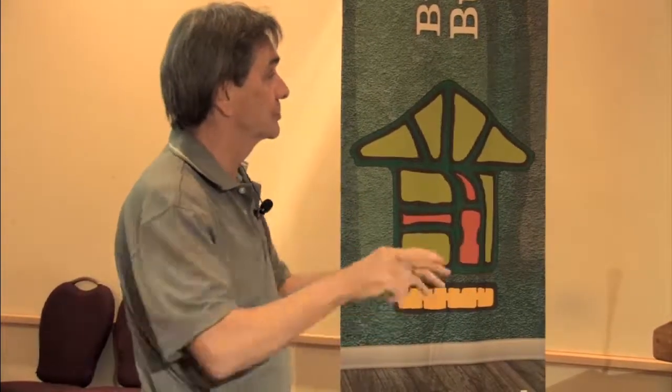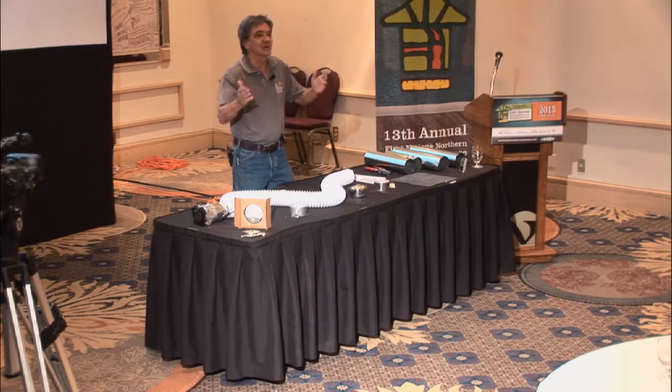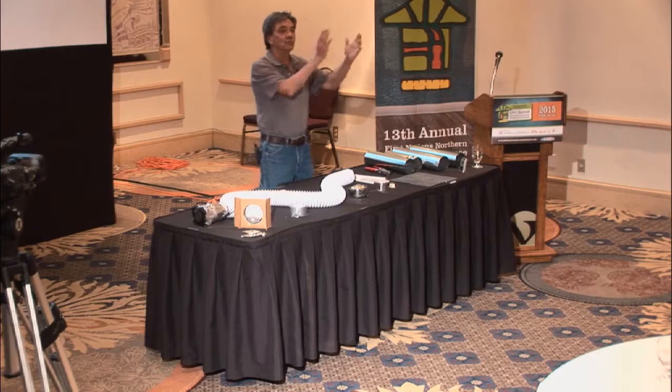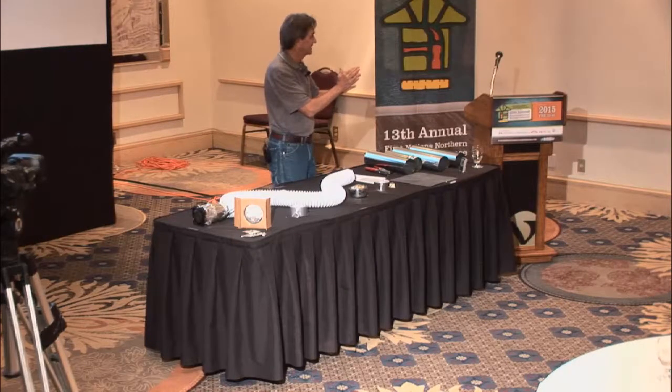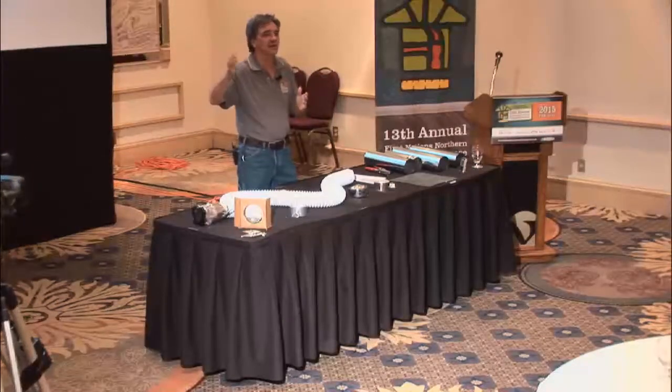And that's what air sealing ductwork is doing. Just as we take the bends out and straighten these things out, if you seal them up, again, you're getting more of that fan on the other end. And the more we can get delivered to the other end, the smaller the fan can be. Because the fan can be smaller, quieter, cheaper, and less money to operate for the amount of air I've got coming out the other end. So by cutting all these losses between the fan and the grill, we actually have the opportunity to design down the sizes, because we're actually delivering more out where we need it. That's where all of a sudden this equipment starts working the way they tell you it was going to work. And you put it in the house, it's not doing what we expected. Okay? Because we're not delivering on the other end exactly what we need.